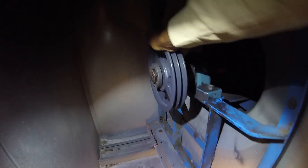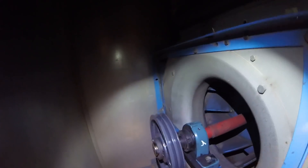But when I went to this one, it won't turn at all — it's locked up. No matter what I do, it's locked up. I can kind of move this one a little bit, but I'm going to replace both of the bearings. One is a fixed bearing and one is a floating bearing, but if you change one, you might as well change both. I think this is the bad one right here.